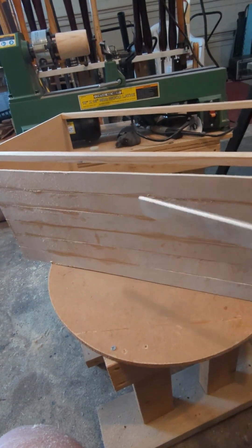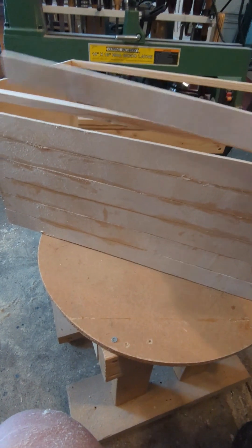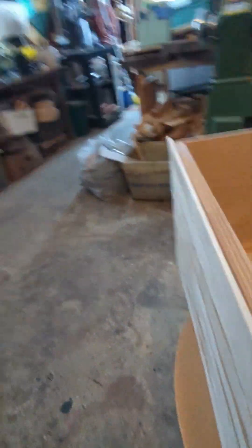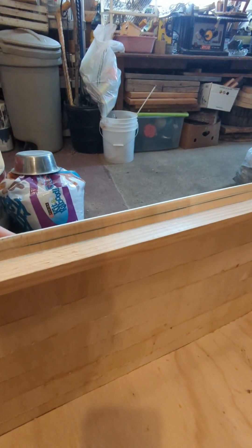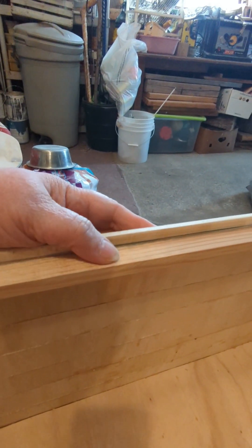I've come all the way up the side, and here's that last piece — this is the top. What I did was scribe it. This is the line — put it up against where it's supposed to be, and then the excess I can now cut off. And it'll be flush across the top, and that'll be one side done.